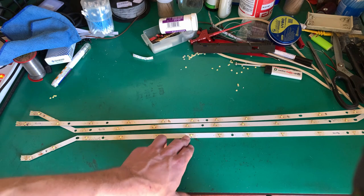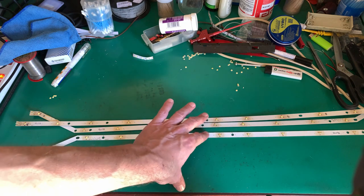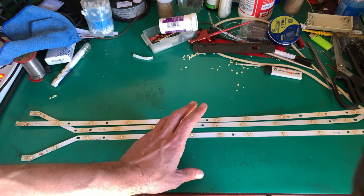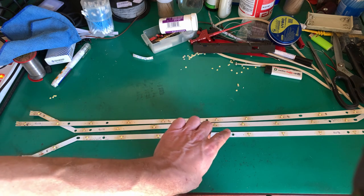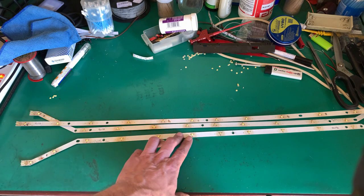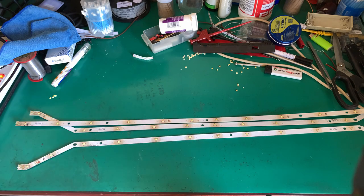The 2835 versus the 3528, the same thing, same height, same width. The only thing is the 2835 is a 60 milliamp LED, whereas the 3528 is a 30 milliamp LED. This is a high efficiency LED, apparently. That's what they've changed. So for the same current, you get less heat produced, apparently. Anyway, this is the flavor of the day. They are relatively cheap. I think the roll with the waterproofing and everything, 5 meter strip, 300 LEDs is about 340 something rand at Communica. Anyway, let's come back to the theory,